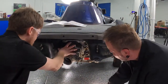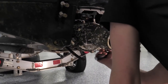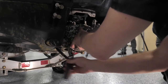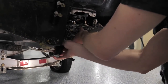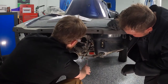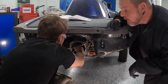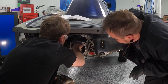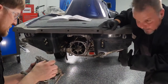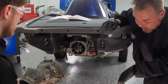Here on these jet pumps on the nozzle end, there are two pry points: one up near the top left, and another down near the bottom right. A small amount of force is usually all that's required — we're breaking that sealant applied right at the seam. That one came out pretty nice and easy. You can see some of the caulking still left over, and you want to make sure you clean that up and apply new sealant per the manual when reinstalling.